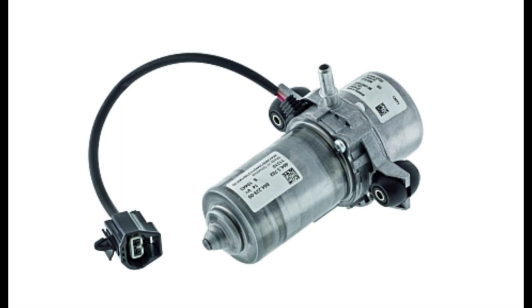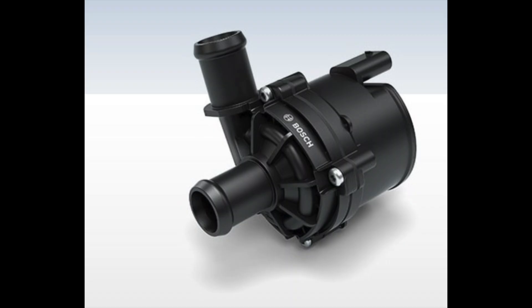This is an electric vacuum pump. Since we won't have any vacuum coming from a motor, we need an electric version. This also came off of a mid-2000s Volvo. It will be creating vacuum for our brake booster so we still have power brakes. In this specific Mercedes there are a lot of other systems controlled by vacuum, so we'll try to re-hook up the automatic door locks and the vacuum reservoir to this pump system.